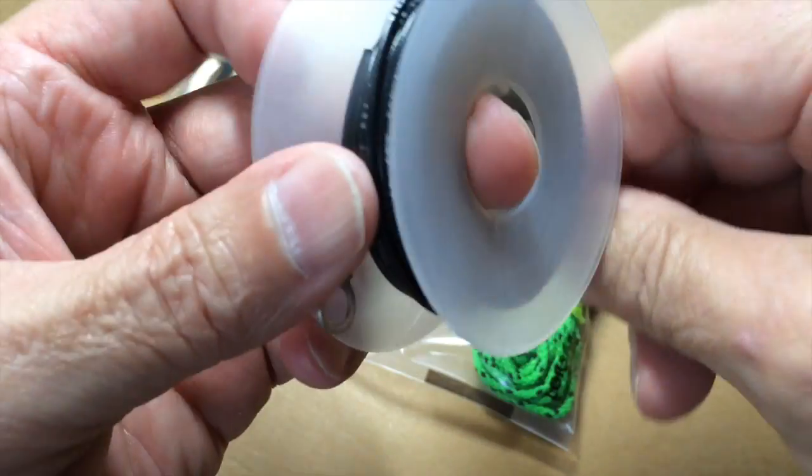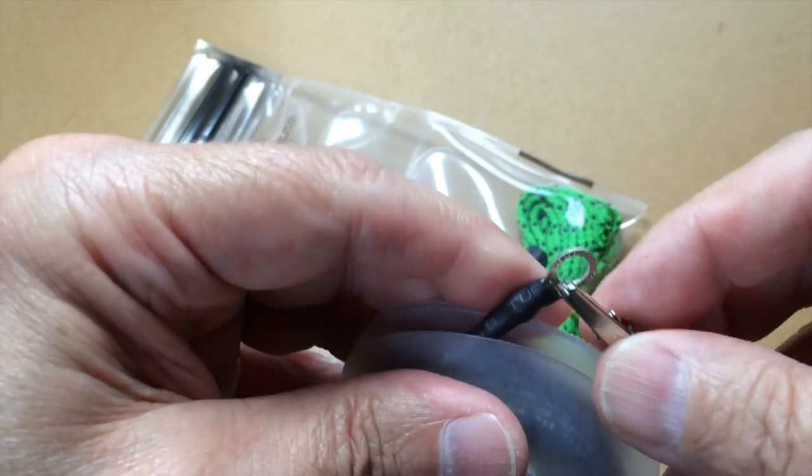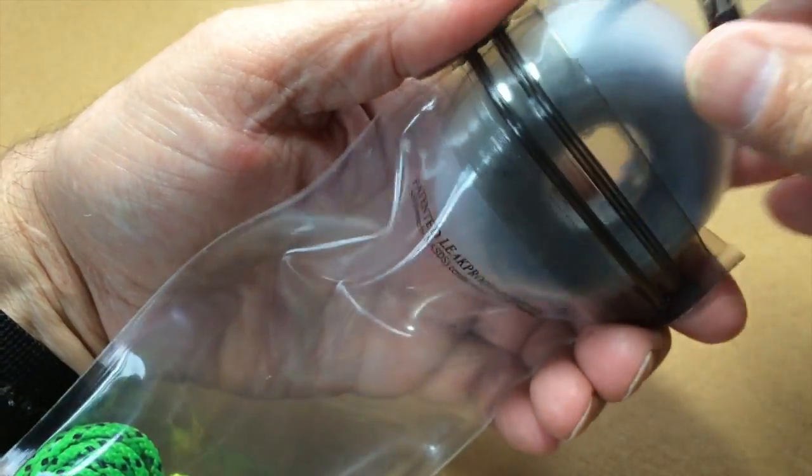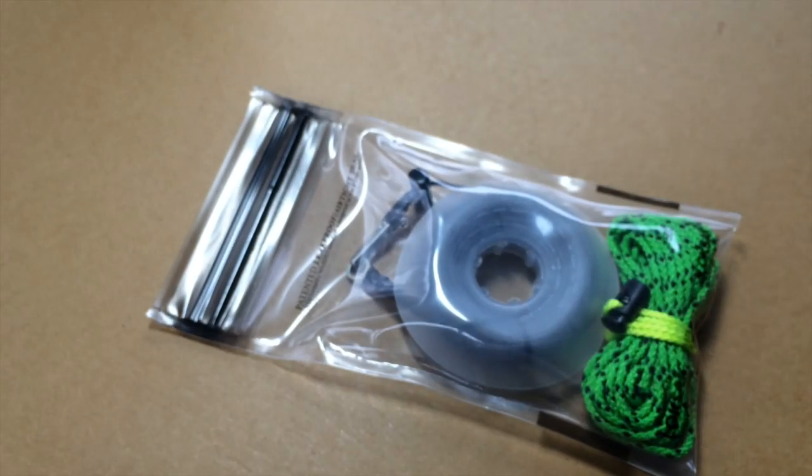This is a nice way to keep a long wire antenna with a small shortwave radio in your ready-to-go gear and have it always available. The whole idea is that if you pull out the telescopic antenna on most of these shortwave radios, it's just really not adequate for good reception. But you can make quite a difference by just taking a piece of wire — you don't even have to make anything this fancy. I just make this because it's much more convenient. You can even just take wire, wrap it around the telescoping antenna, and stretch it out. You're basically just giving yourself better ears.